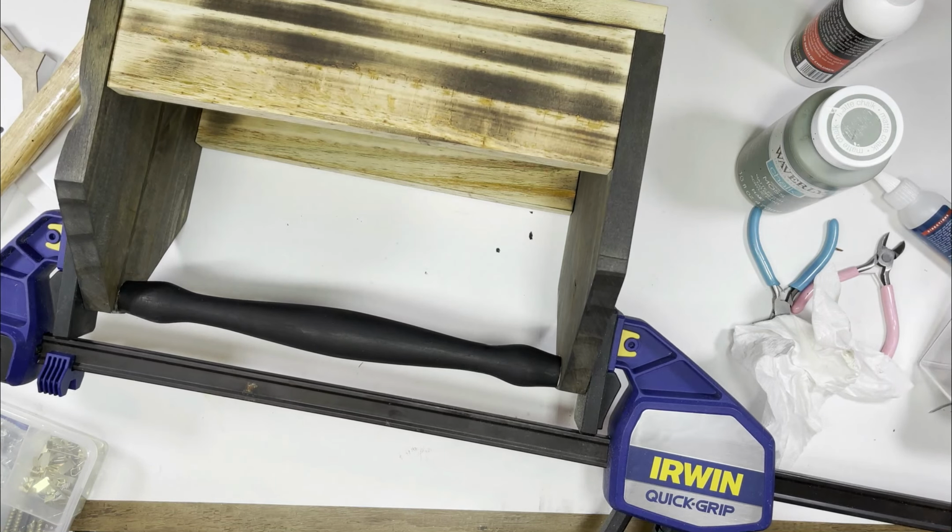What we're doing though is putting it on there and it's giving it a very ashy, white cast. Perfection. And then it's also wiping off some of the paint. Even more perfection. And then I wanted to give it a consistent look. So on those darker pieces that are stained, I added some white wax on, wiped it off. And if it felt like it had some spots that were a little bit too much of the white cast, I took a little bit of antique wax and added that on. I mean, wax on top of wax on top of wax, right? There's nothing better. Anyways, I ended up doing a little bit of it on the handle as well, just to make sure everything ties all together.